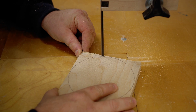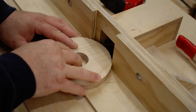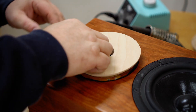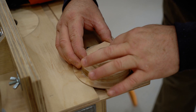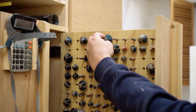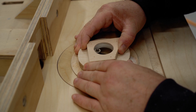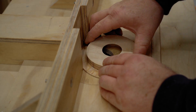I'm going to get a little bit technical about the tweeter and what I chose to do here. The one I picked is a three-quarter inch metal dome tweeter — it's a good tweeter, however it likes to be crossed above 3kHz. I really wanted to cross it lower to match up better to the woofer. I can either use another tweeter, which I don't have on hand, or I can try to horn load it. Horn loading boosts the response in the lower range so I can use that as my crossover point. It also allows me to use a very simple crossover on that driver — just a single capacitor that forms a first-order filter.